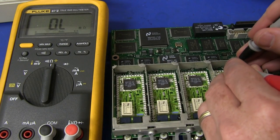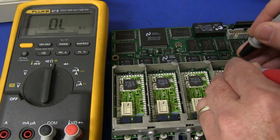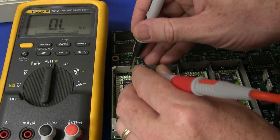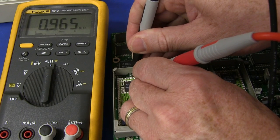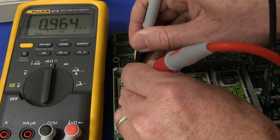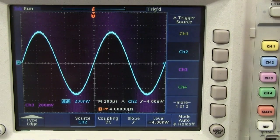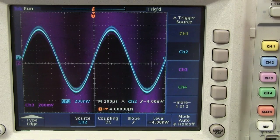Let's measure channel 3 over here. Let's go over to channel 4. Did I get the right pins on channel 3? No, that's a bit of a furphy — we're chasing a red herring there. Right, now I'm feeding in a 1 kHz, 1V peak-to-peak sine wave into both channels.